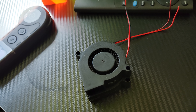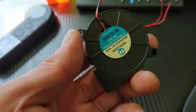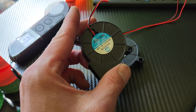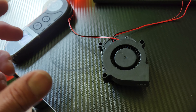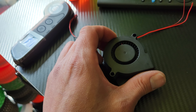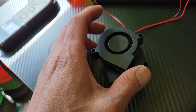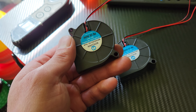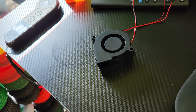It perplexed me — I couldn't figure out what was going on. I had these other fans, GDS fans I ordered on AliExpress. I'm not sure if they're genuine either, but I replaced with those and the extruder is doing fine. Because they're so cheap, they can create noise when the fans turn on and it affects the thermistor on my hot end.